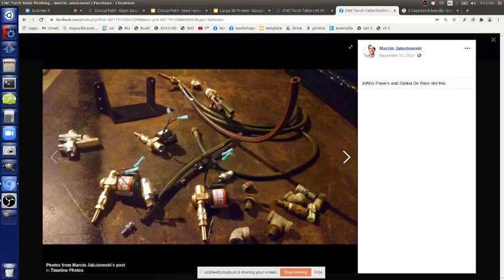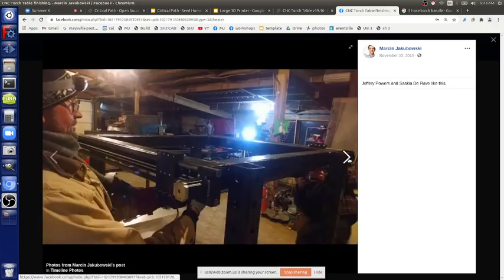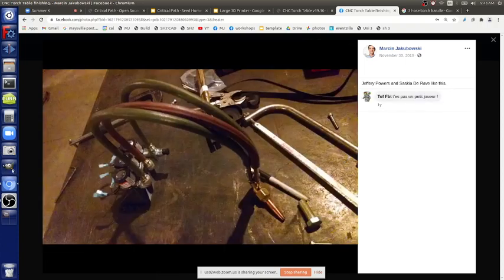You know, $50 for this or $100 for this entire torch assembly, then you just cut off the three hoses, the metal, and put your tubes and connect them to the solenoids. So you connect them to these three here. Do we have the ignition? Yeah, I think that was something like that. That's your new torch head. That's the equivalent of your extruder. That's now you're cutting. So you got the three solenoids.